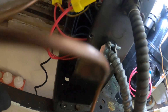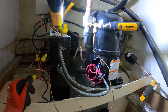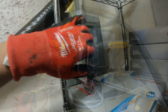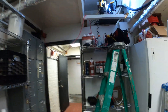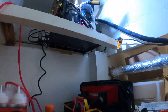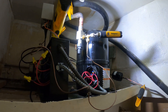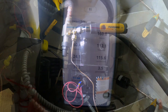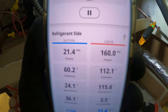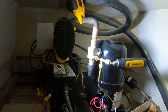Got new connections, ran the BX — looks good. I think my connections are inside. Let's go ahead and turn on the breaker and see what happens. I hear the compressor start — now that is a beautiful thing. We've got 21 back pressure, 160 head. Looking pretty decent.